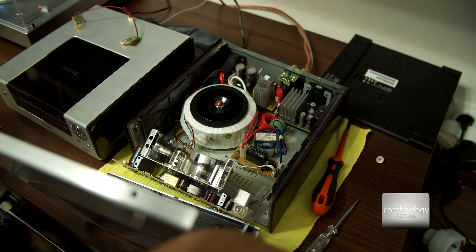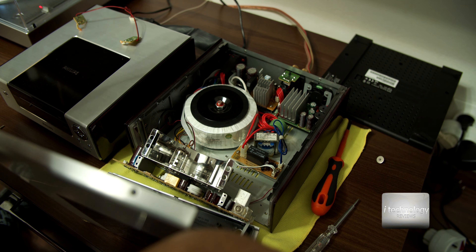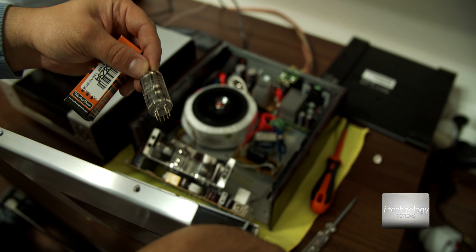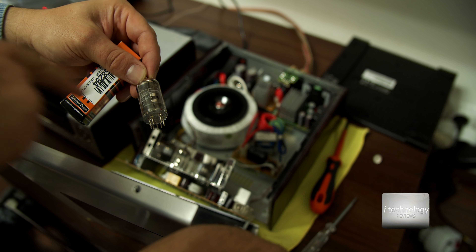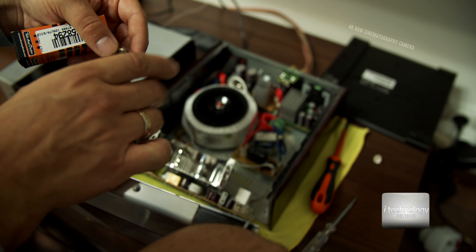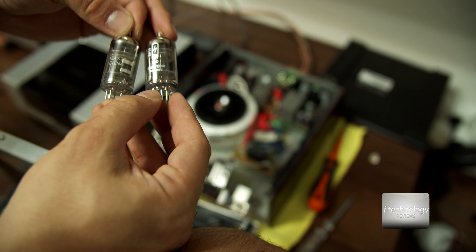To reach them I had to take out a lot of screws and remove the mounting board. The tube has 9 pins, exactly like this. I'll replace them with the AU7. I'm holding it like this, but I'll use a microfiber to remove the grease after mounting the new one. You can push using the glass collar here, but you cannot pull them out from that collar — you have to hold the entire tube.